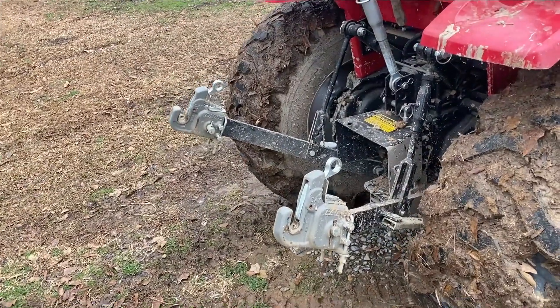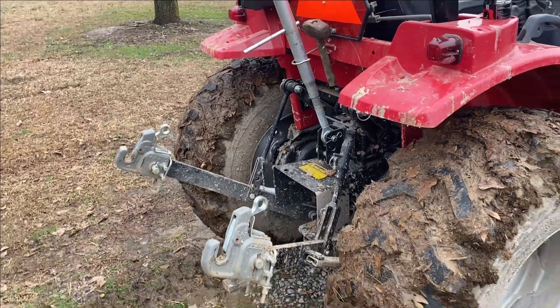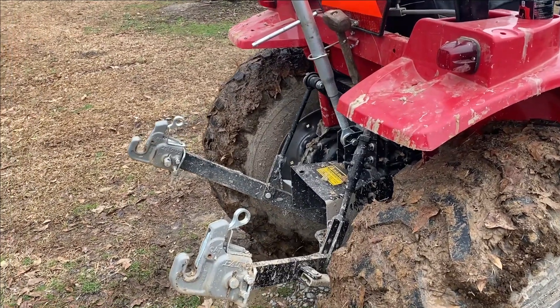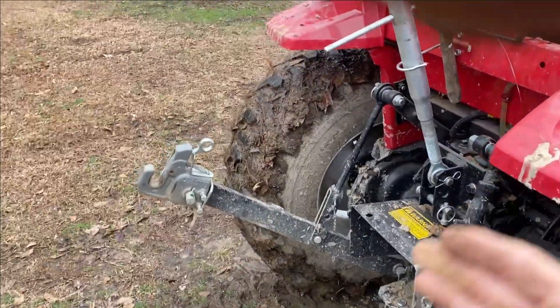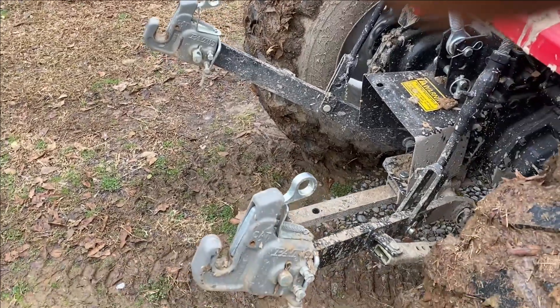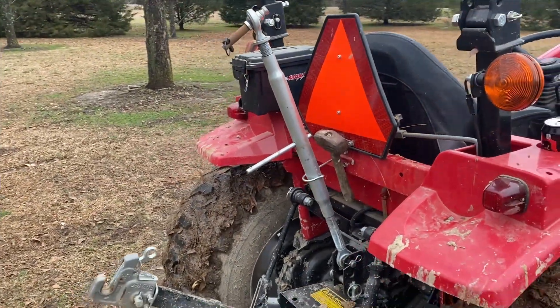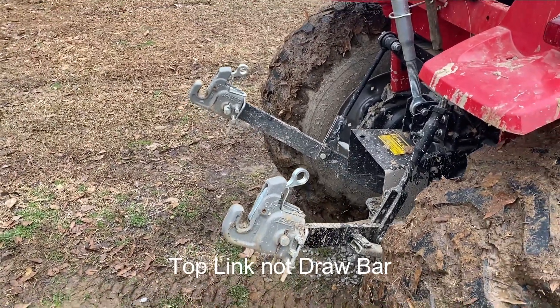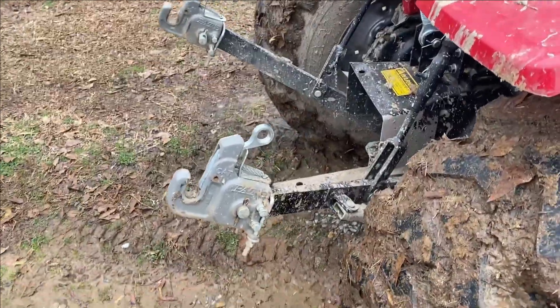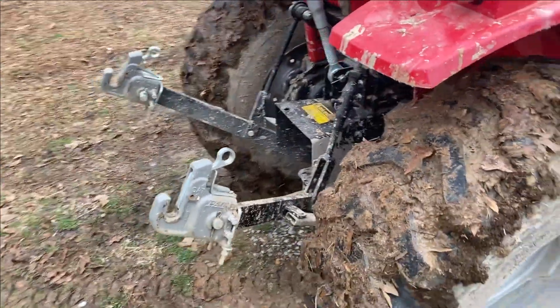After purchasing, I added the PAT quick hitch on back. I'm not one for quick hitches because if you own different or older equipment, it all doesn't hook up because your hitches have got to be in line. So I just got the quick hitch and bought a longer draw bar, and then I can hook it up to any piece of equipment I've got without having to make modifications. These are very nice for their price — that may be a review one day, but there are videos online about that.